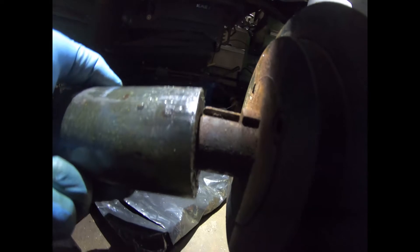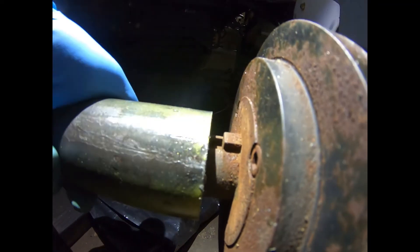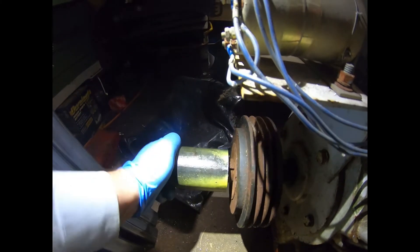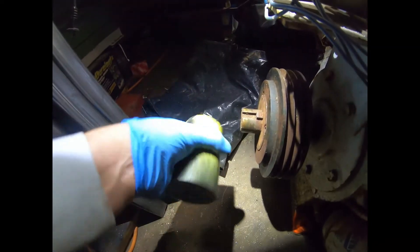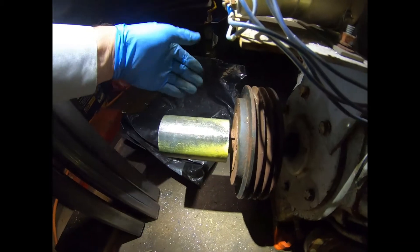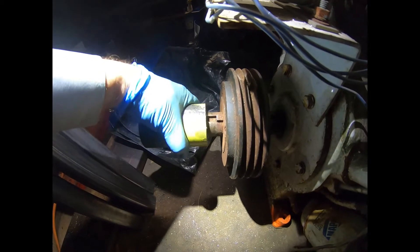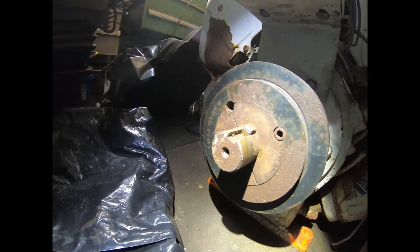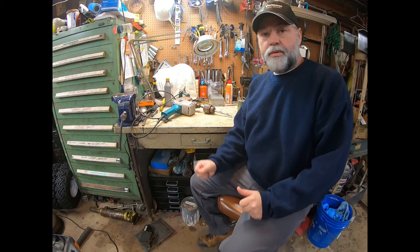We're at the garage now — let's see if this fits on the shaft. Oh, that just squeaks on there, I like that, it's a nice fit. Oh, that's super tight, it's barely got a wiggle. That's close — now it's got almost no wiggle. So this is what we're going to use to drill this crank out. We're going to take this off, get this on there, then drill this out to the right size and tap that hole so we can bolt the clutch on.